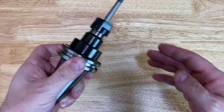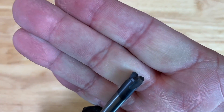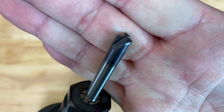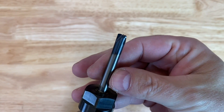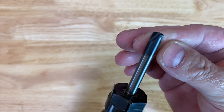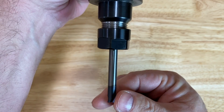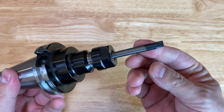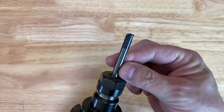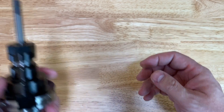This next one is from Lakeshore Carbide - another three-flute cutter, I believe about 277 thousandths diameter, not quite 300 thousandths, but it has a lot more reach for such a small diameter. So when you're cutting a pocket or clearing out the bottom of a feature, this has a lot of reach relative to the diameter. If you have a tight radius in the pocket it works really, really well. Both of those tools have obviously never been run in the X7 - they're CAT 40 tools.